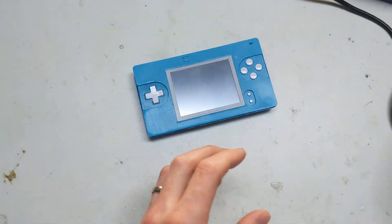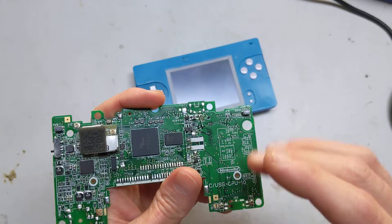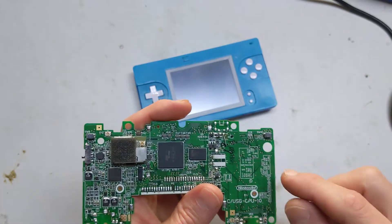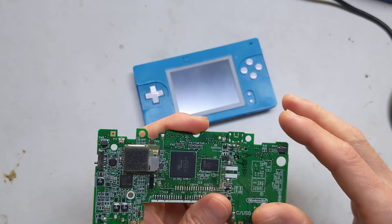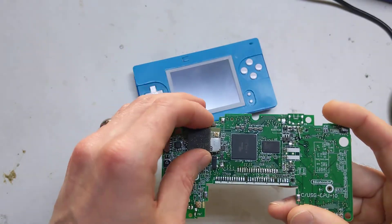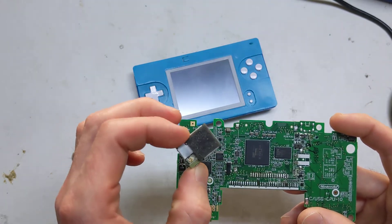I'll show you on the board. There are three different areas you have to solder to — some vias down here. I'll put a link in my blog post with an original image of where the solder points are. You just solder one side of the button to one of these vias and the other side to ground anywhere on the board. I found capacitor C12's top side is also ground, so you can keep it in the same area. The whole DS firmware actually lives on the Wi-Fi chip flash, and people are actually selling these pre-flashed separately.